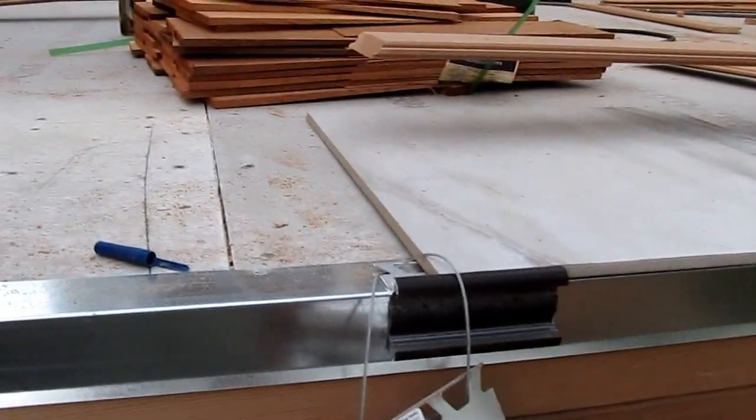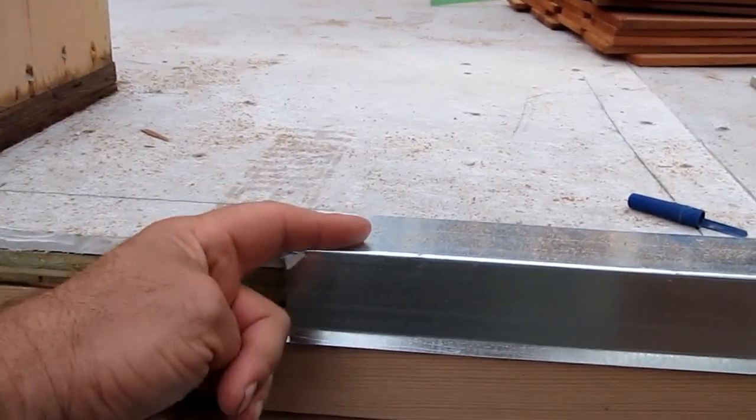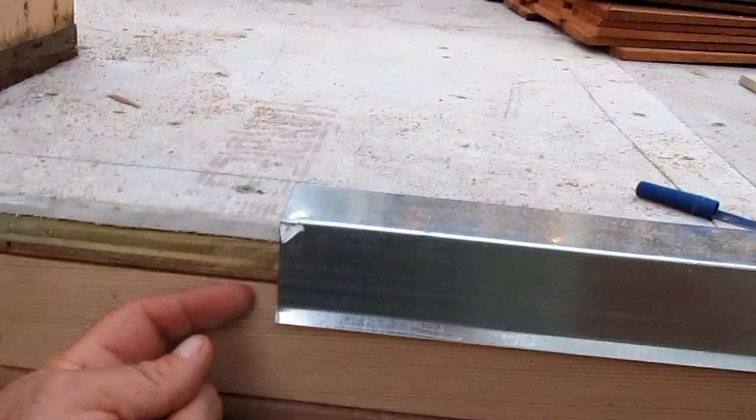This is Paul, Golden Gate Enterprises. We want to show you a detail here of the build-up. You have the plywood subfloor, three-quarter inch backerboard screwed down, and then on the edge we have a piece of flashing that comes down so it basically covers and waterproofs this, and it comes over the outside of the siding.